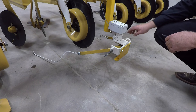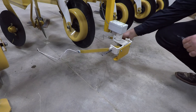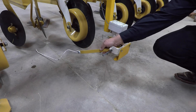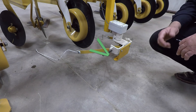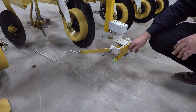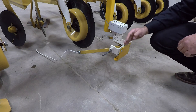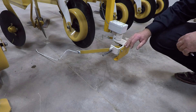The wand sensor is designed to sense two crop rows at once, with two independent wands each sensing a crop row, set in a V configuration so they automatically feed into the crop row. A skid plate is mounted on the front to help protect the wand sensor and also act as a counterweight for the wands themselves, making them much more sensitive to a small crop.